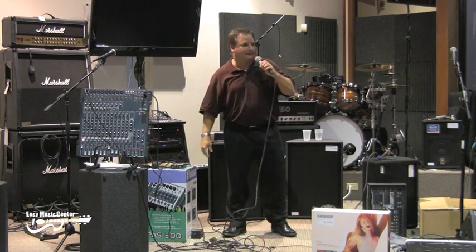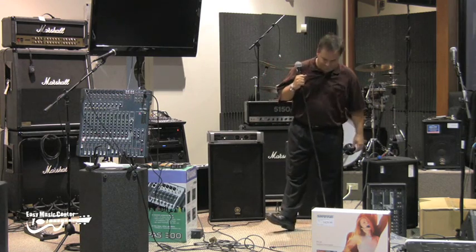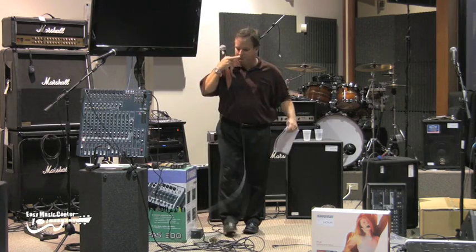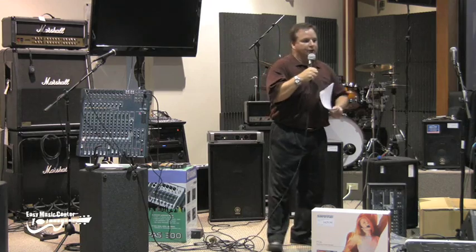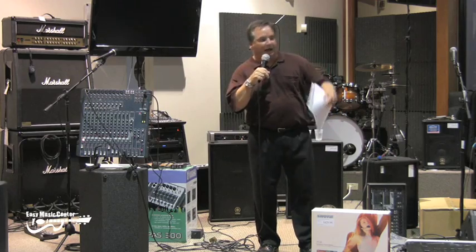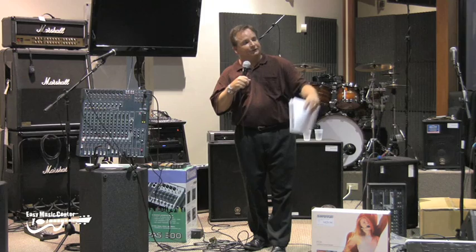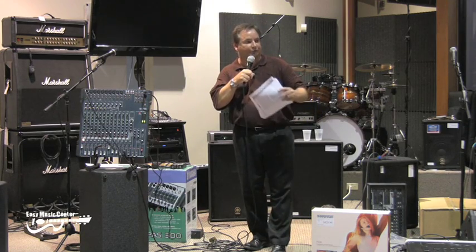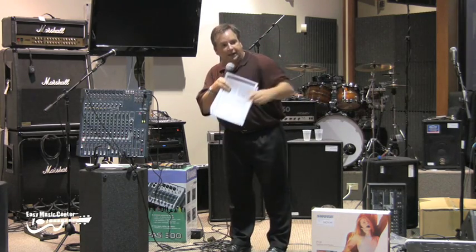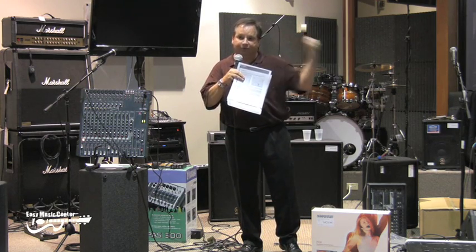Can I ask a question? Yes, ma'am. You said pull things out until the hum stops — where do you pull them out? In the mixer or on the stage? I plug things on the stage like my keyboardist at my church. The lady's question was, where does she pull out the cables if she's having noise problems? I'd start at the mixer because that's the easiest place to get to all the connectors. Sometimes you aren't able to get to all these connectors so easy on stage. At the mixer, you can get to every one of them. And if it's a keyboard and there's two plugs, maybe pull them both out because you may find that the noise is only from the keyboard.